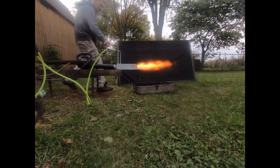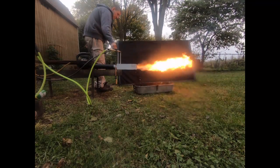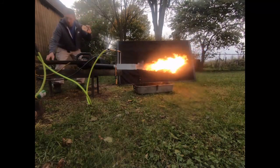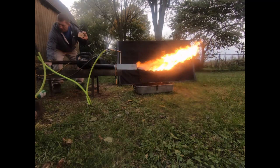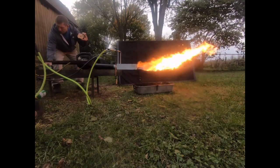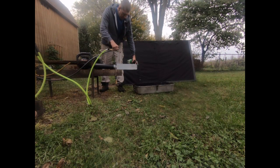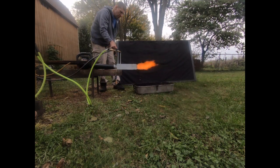That's what I've got going on today. This is just for my guys who don't have a large air compressor and they want to be able to do some smelting. This setup can be miniaturized — I just built it this size because I wanted to cut one of my Godzilla burners in half and use that as the flame holder. You do want to have that flame holder effect in there because you get eddy currents that actually draw the gases in the reverse direction, and that fire traveling in the reverse direction is what maintains the stable combustion we see on the interior.